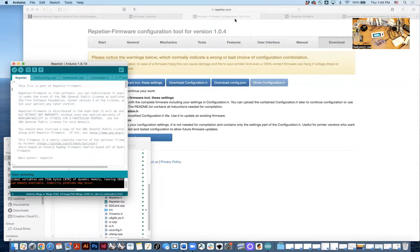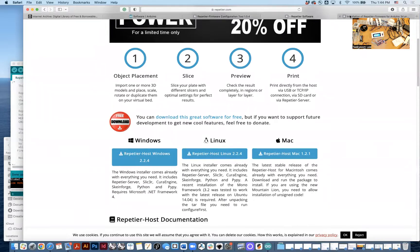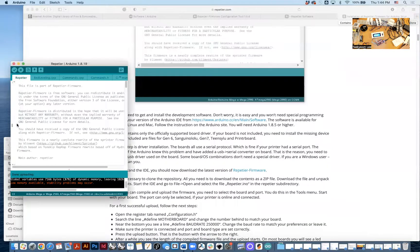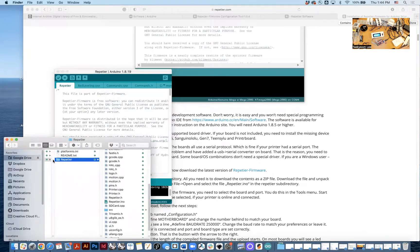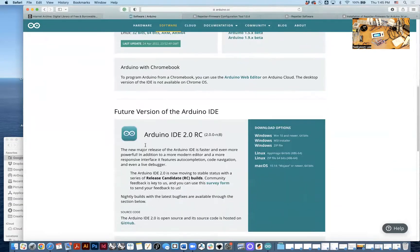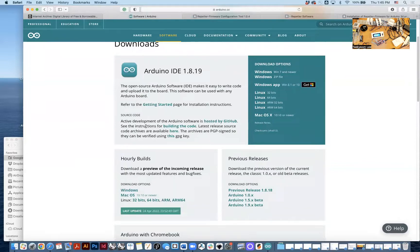It's done uploading. For your information, you can go to the Repetier website — there is some troubleshooting there; you can feel free to Google it if it gives you a hard time uploading files. Sometimes that happens because of version differences — errors can happen. Before taking this video, I did some tests: Repetier firmware 1.0.4 and Arduino 1.8.19 is working. If you are not sure, you can download the old version of Arduino IDE — there are some legacy versions that will work fine as well.